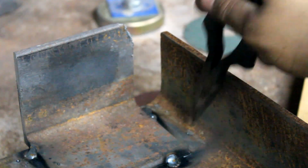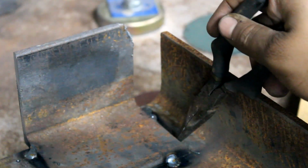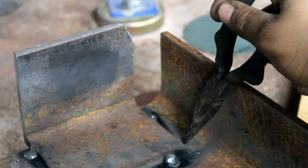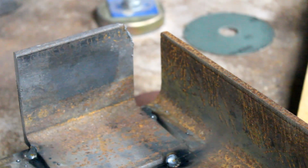Now, most common spot for this that I've seen since I've been working is angle. Most of the people's welds be on the beam and not enough on the clip, or their angle's too steep and the gas gets blown away and you get porosity. Grinding in that is very difficult. This is just a mock-up joint, so everything is going to be a little bit different and weird. So we're going to weld this up and I'm going to show you some angles.